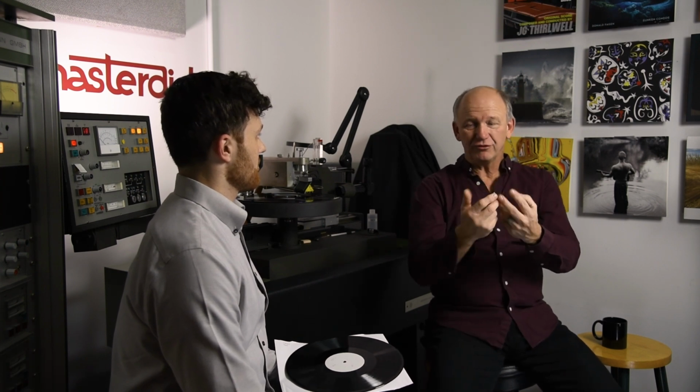So that's before we've made the master, we make a reference disc. After we've made the master, it goes to the plant and they make the metal parts and they stamp a record. And we listen to the test pressing to quality control check the metal making part of the process and also the stamper and the mold. Most of those metal parts really can't be played. They're inverses, they're made from each other. We really can't identify any significant noises in them unless they're massive. So we have to wait until they're ready, put the stamper in the press, and make test pressings.